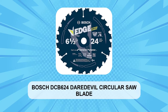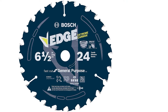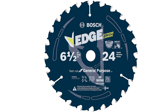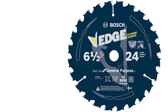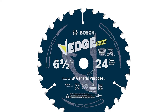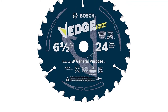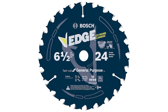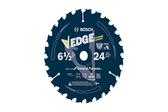At Number 2: Bosch DCB624 Daredevil Circular Saw Blade. A framing blade is usually designed for rapid cutting of dimension lumber and other softwoods, and the Bosch DCB624 focuses on framing. These blades are not designed for making fine furniture — speed is more important than finish quality in framing, because the resulting cut is usually hidden. The Bosch Daredevil has an ATB tooth grind, the optimal choice for fast ripping and cross-cutting. A substantial amount of material is behind each tooth, which, in addition to Bosch's proprietary brute carbide, provides strength and high-impact resistance. The blade contains a low-friction coating that resists overheating and helps prevent blade distortion, key features in a blade that must cut for long hours every day.